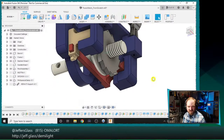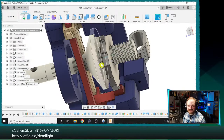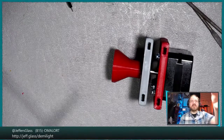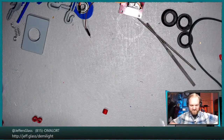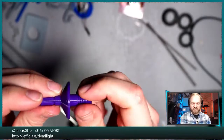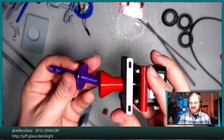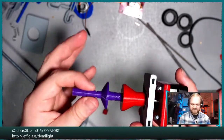Let's see here. This is our barrel, our ratchet. I can deal with the ratchet wheel and the washers that go on either side of it last. So it's really the barrel, these two arms, the frame, and the bearing that have to all happen simultaneously. I'm going to zoom way out for now because I'm not sure how to capture this in a way that will be visible. So there's our new lovely purple PETG barrel, the part that interfaces with our friction setup, our threads that interface with the thrust cone, transmission cone, transmission linkage, says Chris. Not bad. So there's that.